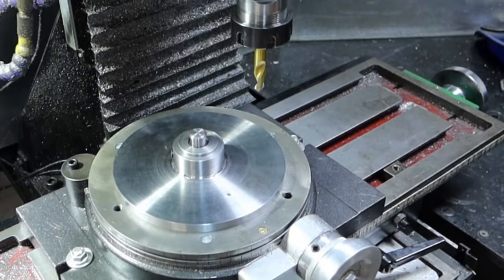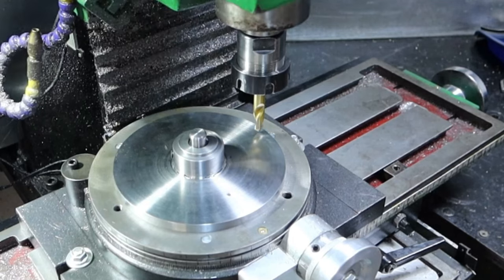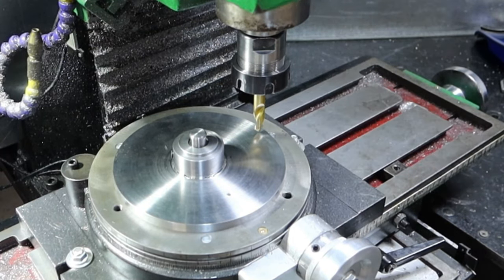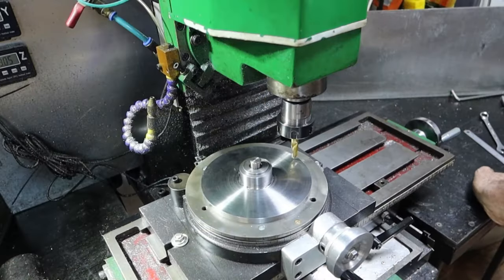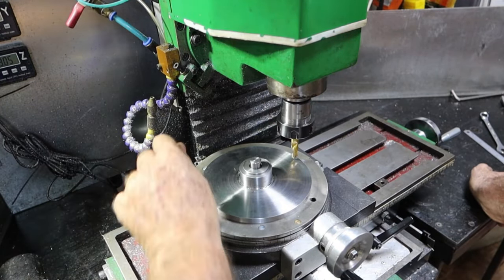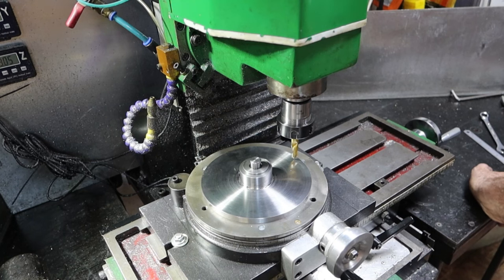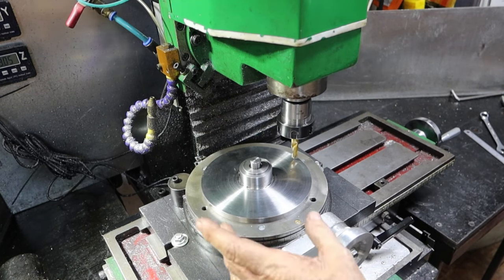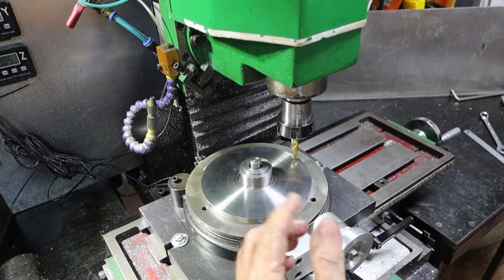Where does that sit on there? It should be how far in from the edge, is it? 7mm. Right, now, so I have a fair bit of faith in my 10 degree marks on this table. I have absolutely no faith in the 1 degree marks, so I've got a little something to show you later on. Deal with the vernier scale, which has to be at 11 degrees.